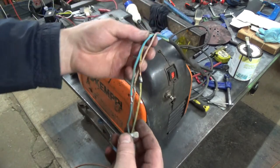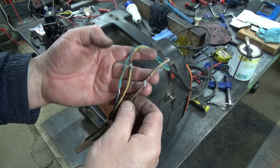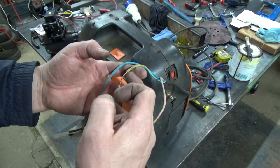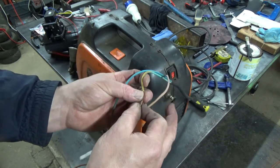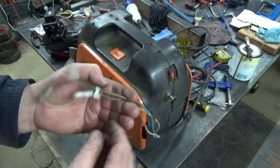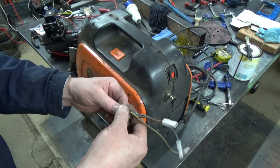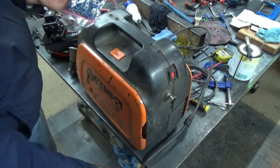they replaced the cable, and instead of crimping on new ends, they soldered these, and obviously whoever stripped that back, they stripped it back too far, and that's the earth, by the way, and the heat shrink that he put around it, I've removed the heat shrink, by the way, had burnt through there, chafed through. Whether that was the problem with it, I don't know. Been trying to get some of these ends so I can put it back as standard, but they are proving hard to get. So I have just ordered a set of blue female spade ends.